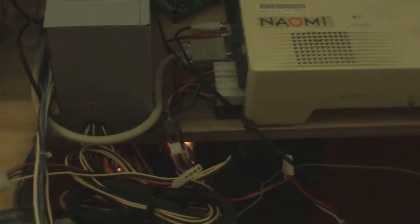You're going to need a power supply — this is just a cheap Dynex power supply. I don't particularly recommend using a cheap one; you should use a good power supply. The Naomi needs a 3.3 volt rail, which is not common on a JAMMA power supply, so I had to make an ATX harness to the Naomi plugs, which are a JST plug. You can find sources for this online.